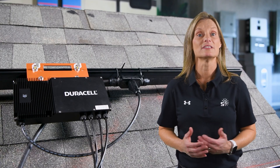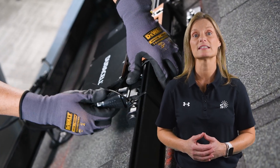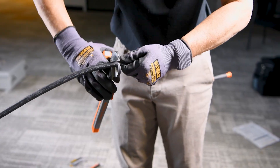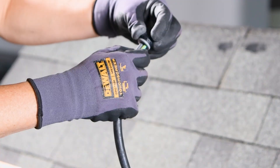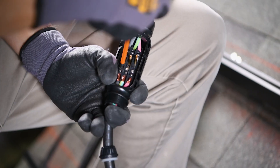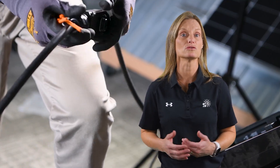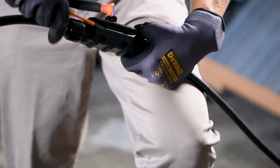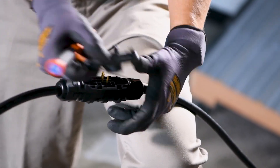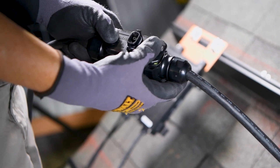The modular trunk cable is designed to be versatile. It comes in 2-meter portrait and 4-meter landscape versions for cleaner installations, but it can also be cut to length when needed. Installers can even mix cable links to match the layout. If a drop location needs to be changed, the drop cover can be removed with the official drop tool or even with small screwdrivers if the tool isn't on hand. The cable can then be re-terminated to match the desired spacing.